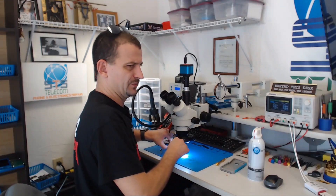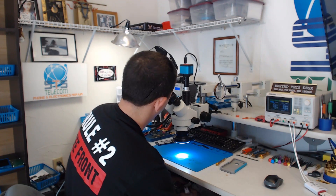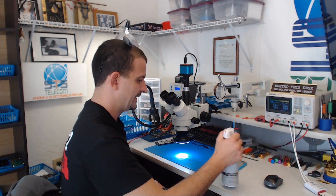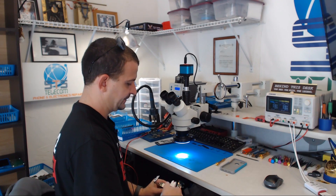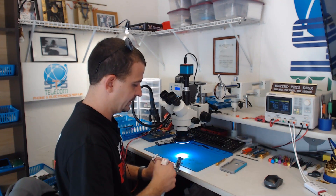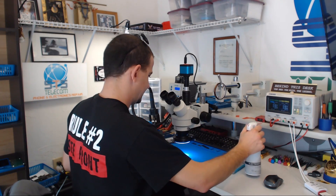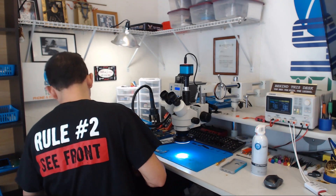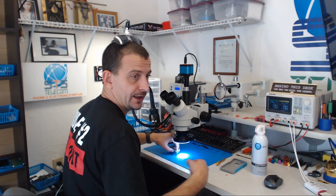This stuff's really disgusting. Let's blow this out of here. Guess who's gonna order some freeze spray. Since I got my thermal camera I just hardly ever use this stuff anymore — I look at it once with the thermal camera and then I use alcohol to fine-point it. But in this case the heat's just like really spreading out, and I think it's the CPU that's getting warm first. Let's open up and see if I've got a schematic.